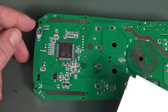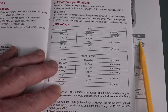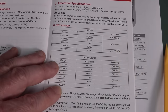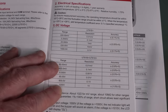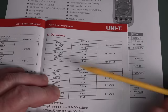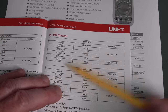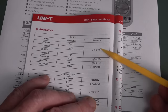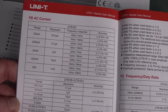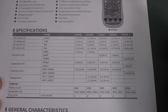So what's my verdict on the new Plus model? It's definitely an improved meter over the original E model — bigger display, faster bar graph, some extra features, AAA batteries, accessible fuses, improved build. But the original E model's major appeal was being 22,000 counts at under $60. They've increased the price by practically 50% to nearly $90, and for that money you're not even getting temperature measurement — instead you get a useless transistor tester.